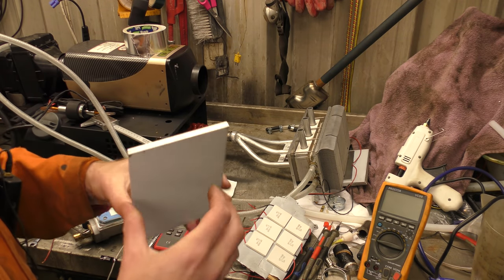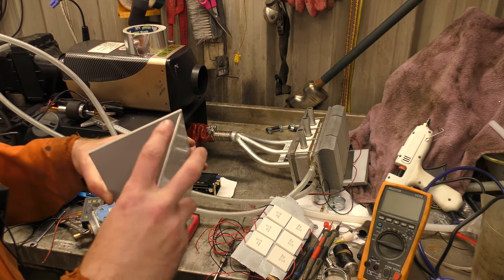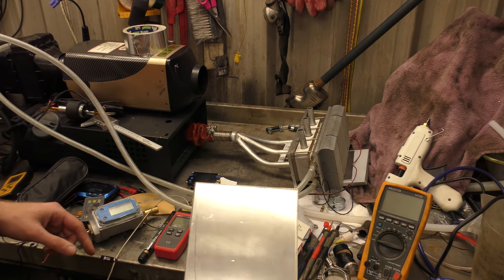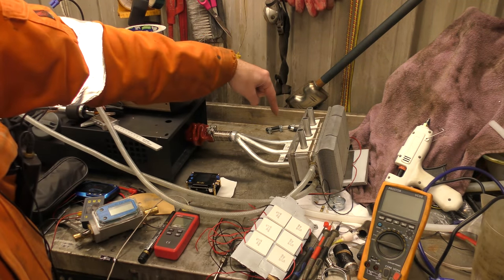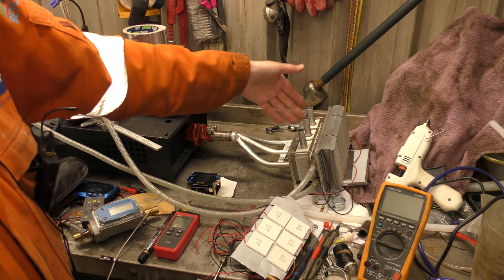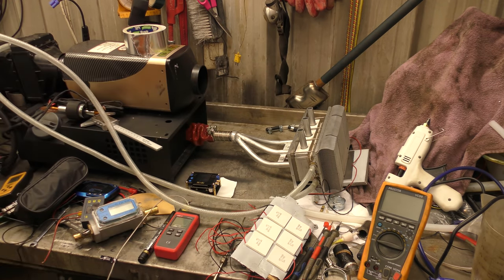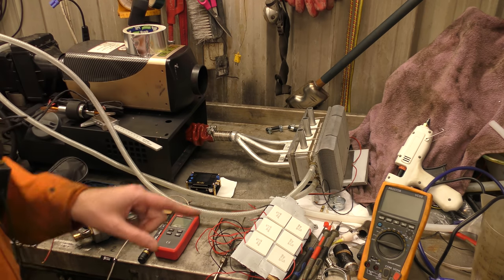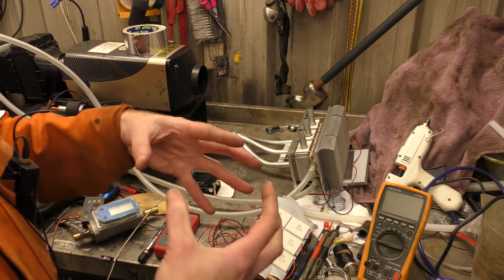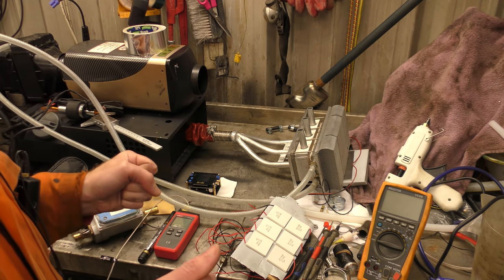And then we could try to put fins on the inside to maximise the contact area of the exhaust, because I think that's probably what made that generate more electricity, was the fins on the inside of the heat exchanger, which allowed more heat to be transferred into the TEGs. So if we can do that, I might buy some cheap heat sinks, that's what I'm looking for. Heat sinks to either stick on or weld on, if I can, on the inside.